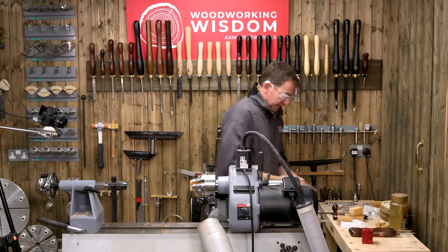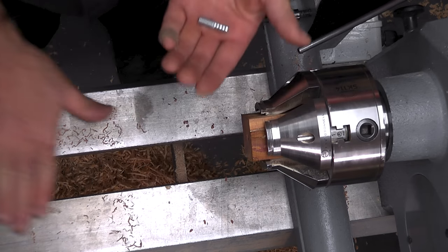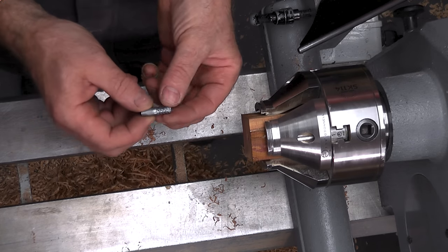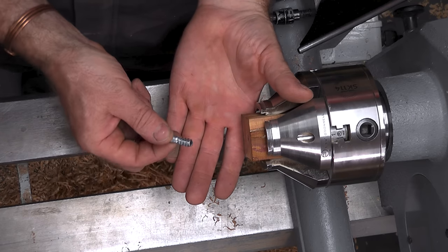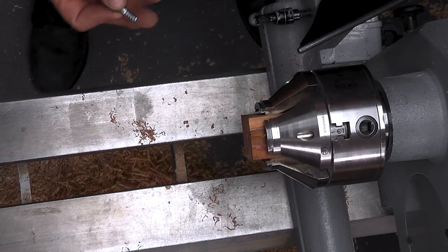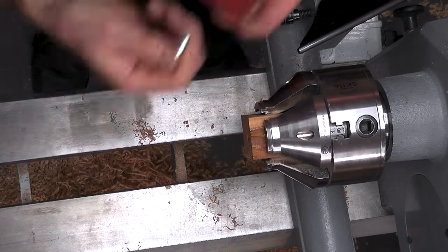We've now got to get our stud into that. And this is something, if you're doing them, you want to glue them in, you can put some CA glue, you could go with a slower setting CA, so probably thicker. You could go with something like a 30-minute epoxy or a 5-minute epoxy, depending on how much time you've got. If you're going with the plastic blanks like the acrylics that we said, definitely going to need to glue the stud in. Don't try and wind this in and cut it or fracture it and chip it.